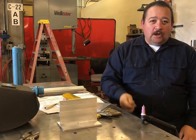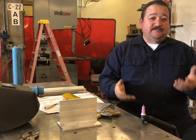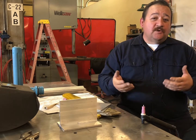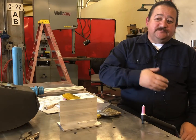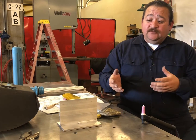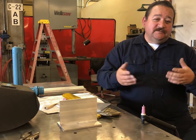And so today, helium is so expensive, and people like to use AC, and AC can actually cause problems because if the frequency is wrong, you could actually spit tungsten onto your part. It could cause flight hardware to fail. So that's why DC was such a better choice to use in the past, but it isn't being used any longer today.